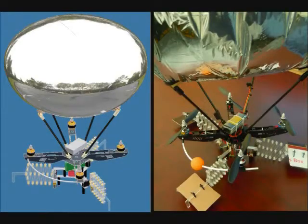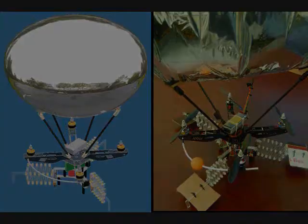To compensate for variations in roll and pitch during flight and manipulation, a buoyancy envelope was attached to the quadrotor to provide restoring forces and an increased moment of inertia for the vehicle. By analyzing test runs with and without the buoyancy envelope, we have verified that the hybrid structure does improve flight stability.